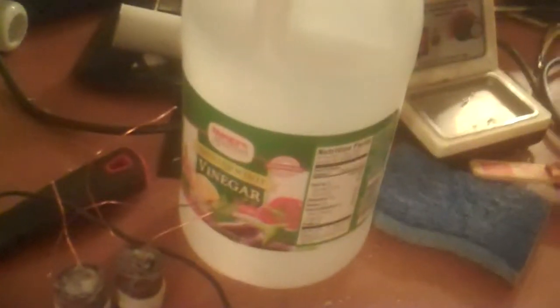Thinking about this water-wise, I tried to rehydrate the crystal the same way I did the first time and got real marginal voltage increase — nothing real. So I want to see what happens if I just saturate it with water. I've got it in a cup of water so all the crystal will eventually get saturated. My voltage came up to 1.22 and seems to be dropping a little bit. I'm not sure if this is going to be the right fit for that 6-volt capacitance charger I wanted to do. I've set up a new cell — it hasn't been wetted yet, voltage is zero — and I'm going to try vinegar to see what it will do.